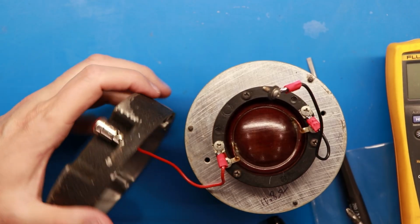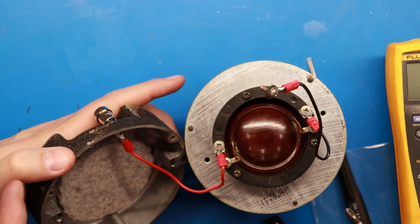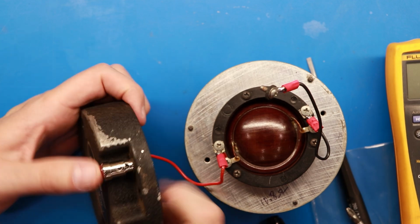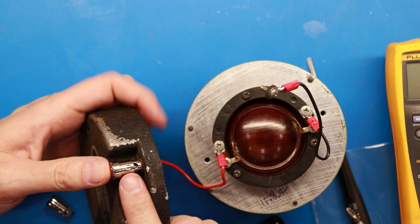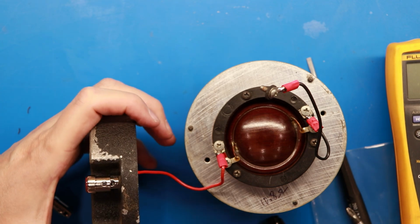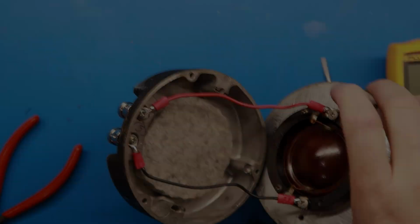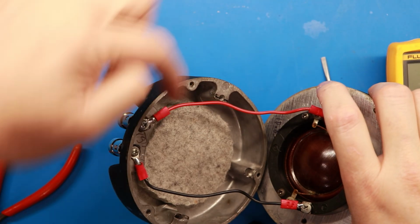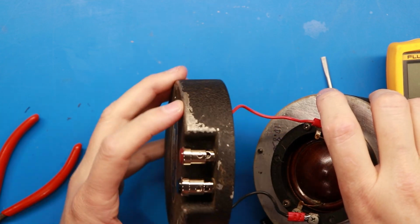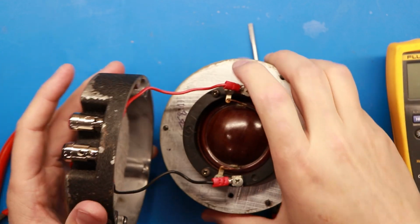All right, when putting the binding post on, you want to make sure, one, you're coming from the side here and not straight in or across from the other side with the terminal lug on the back. And two, you want to make sure that this little hole that you stick your wire into is sticking straight outwards, so you're not off to one side or another. But once you get that tightened down, move on to the next one. It's a little bit of a juggling act to get the wires coming in from the sides. Then you've got to get the binding post with both of the holes outward and make all that happen.